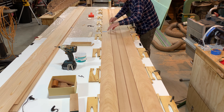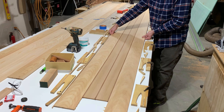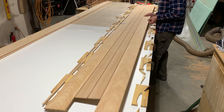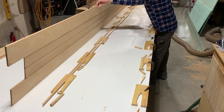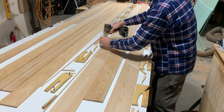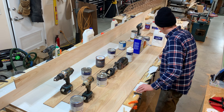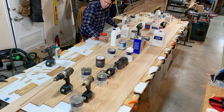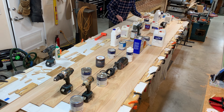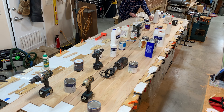Those are little survey marks to keep my book matches perfect — those blue tapes that I just peeled. Then I just cleaned the top perfectly so that it was basically right out of the planer, so I didn't have any glue blobs. The underside you pretty much have to sand every time so you don't have stuff keeping you up off the bench. Then you glue your second set on, your third set, and by this glue-up you now have the full width and full length panel, ready to glue onto the frame.